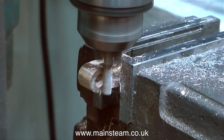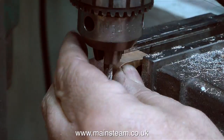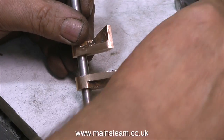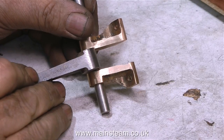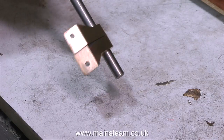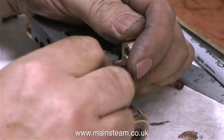After drilling the holes for the mounting bolts, I heated up the part and separated the two individual pieces. I'm trimming one piece, followed by the next, to the exact size shown on the drawing — and you can see this because I'm using a micrometer to keep checking it. By using a reamer to accurately size the holes in the bracket, the fit is quite good on a piece of 5/16th of an inch diameter stainless steel. Even though I've got the brackets back to front, you can see the principle — in between this bracket is fitted the drop arm.